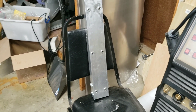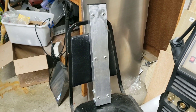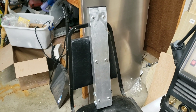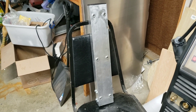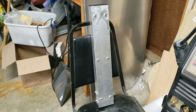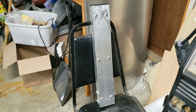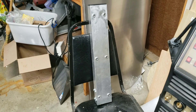This thing is all ready to go. I decided against painting it for right now — I'm going to get the mill ready, get this thing clamped in place, and start marking and drilling the holes. I'm going to try to drill it in place where it drills into the casting, which shouldn't actually expose the inside where the ball screw is to any cast iron dust.